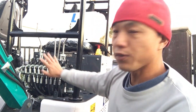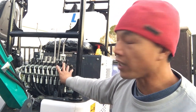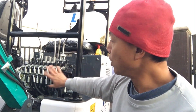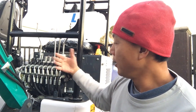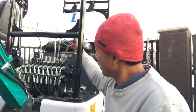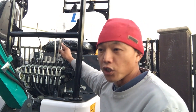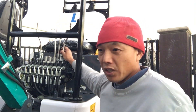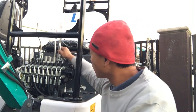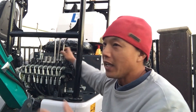So what are the pros and cons? The pros: it's really simple. If you ever need to do any work on it, or just buy a small replacement valve, it's very simple to do — basically no electronics, so you can't get any simpler. The cons: because it's movement-based, you have to move the lever all the way to get a good, fast action. When you're working and digging constantly, your hand is moving left and right, front and back — imagine doing that for six or seven hours a day, more than three days a week.